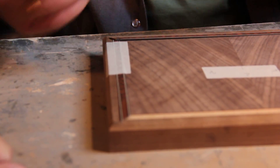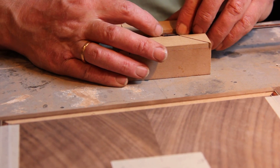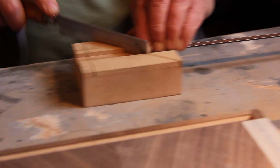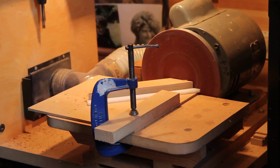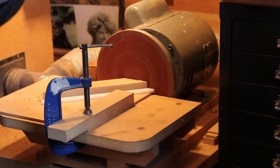Mark it on the innermost of those black lines because that's actually where they meet on the inside edge. I've left a little bit extra - I'm going to leave the line and just remove most of that. This is the most critical operation because if you over-shorten it you get a gap, and if you under-shorten it it will be too tight and you'll get too much of a bow and it won't go in place. So it's got to be spot-on - be conservative to start with.